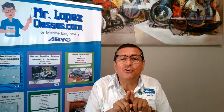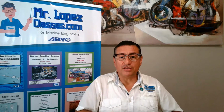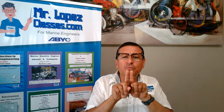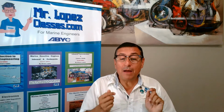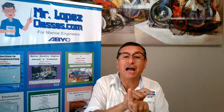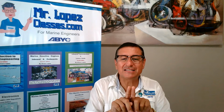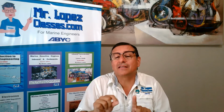This is galvanic corrosion. Yes, because each metal has a different level of energy, different electronegativity, and a small arc of electricity is produced between both metals. This is galvanic corrosion. What happens if you have the same two different metals together and additionally a current passing through those metals? The corrosion is accelerated. This is electrolysis. Electrolysis is galvanic corrosion plus an external current.